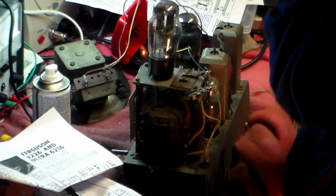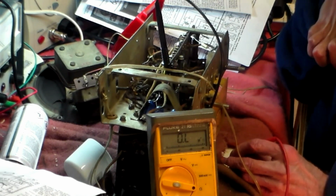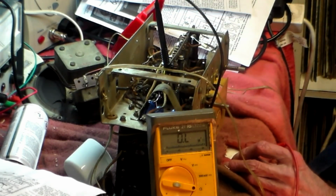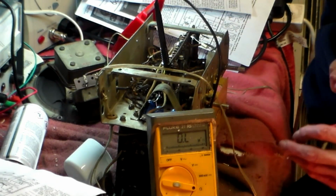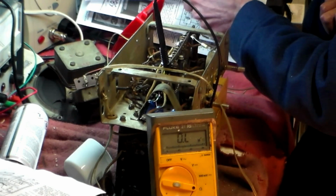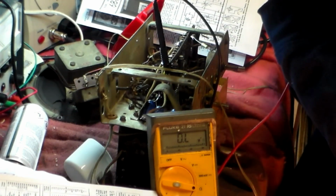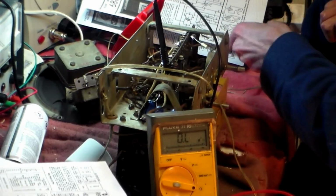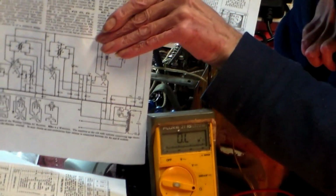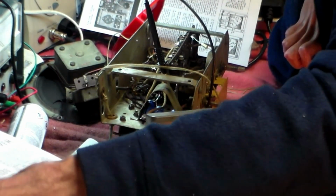It might not. Well, cleaning those tuning capacitors didn't make any difference whatsoever, and I found the point where it goes off, and it goes off gradually as well over 100 hertz or so. So it's obviously going so far and then failing. Now, in this situation, I know straight away that the IF is getting through. We know that, and so the next thing we look at is where on the circuit it's not doing anything. Now, therefore, the circuit is here. It's the circuit, and as you know already, R4 6.8, I think 6.8.